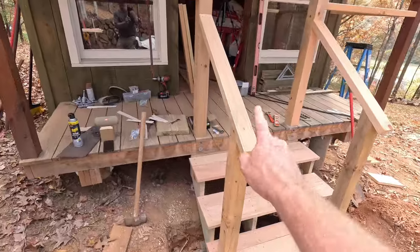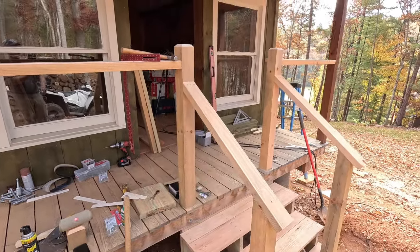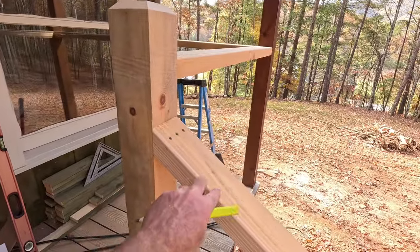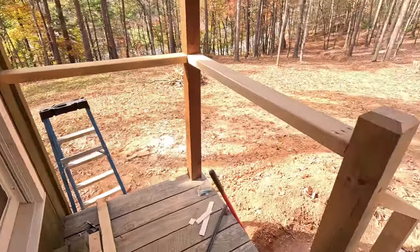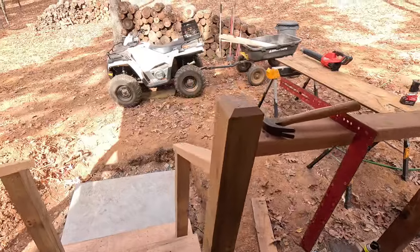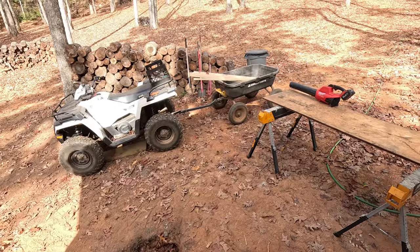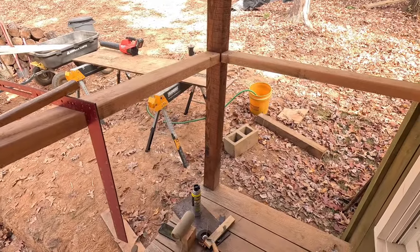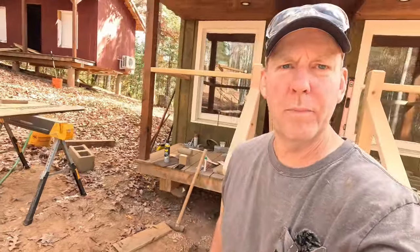We've got some railing put up. These railings are 36 inches; the guardrail here is going to be 42, and everything is going up just fine — it looks great. I rounded over the edges on both the railings as well as the guardrails on top. I was up part of today ripping down some boards — these are one-by-ones that I'm going to use in the railing section, and that'll explain itself as things get going. As of right now, we are working away pretty well. I think the rain's holding off for today; tomorrow is probably going to be a different story.